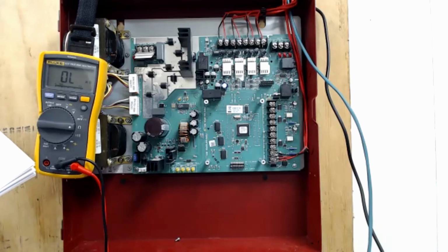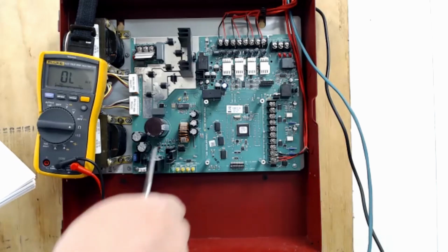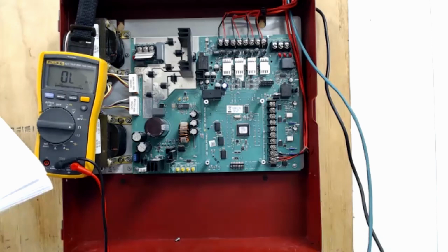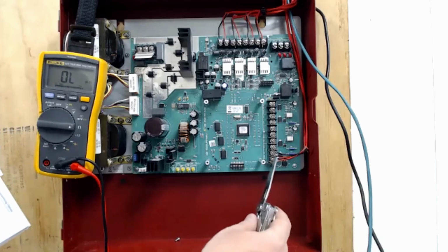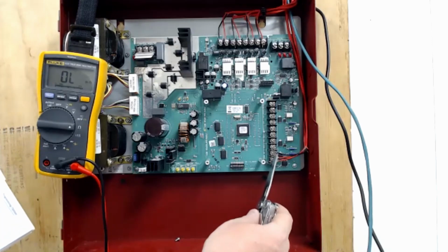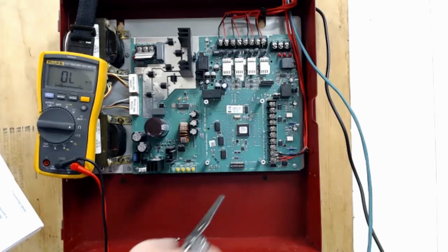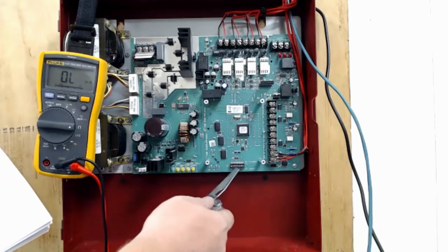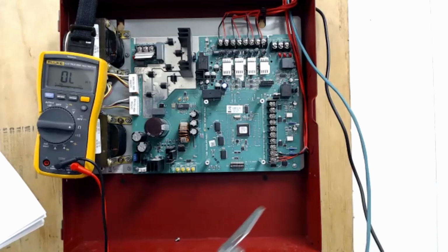Switch number 3 is if this is configured as a slave or follower. If you turn switch number 3 off, which is the default out of the box, it'll ignore whatever signal's coming in on here. It won't matter if you land wires or not if 3 is turned off. It'll create its own sync. If you turn 3 on, then it will follow whatever sync is coming from here.